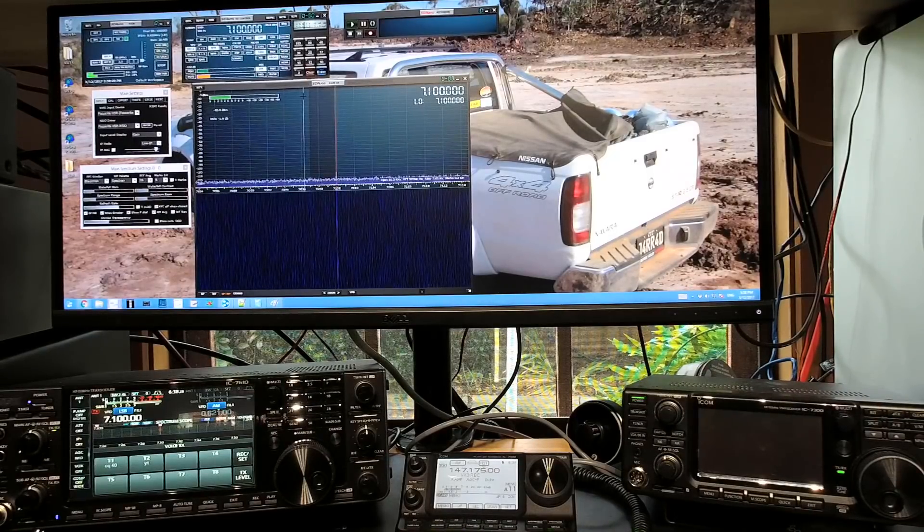I'll give you a bit of a spoiler alert. At full power, it's about 30 decibels down from your transmitted bandwidth. Now, that's not the ARRL-style measurement — that's a dBc. The ARRL call it IMD3, based on peak. I'm doing it based on the peak tone in my voice. So basically, add 6 decibels if you want the ARRL's version, or subtract 6 decibels if you want my version when you're comparing. So yeah, it's about 30 dB — it's good, it's what you'd expect for a 12-volt radio.